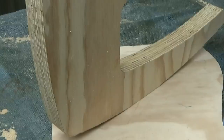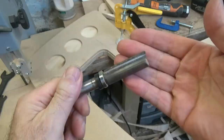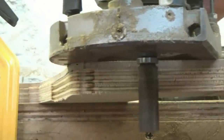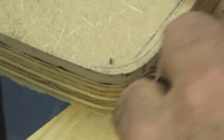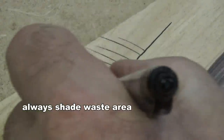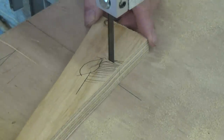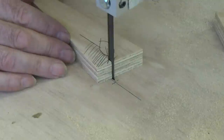So I set up a bigger router and used my top quality router bit — somewhat old looking but perfectly serviceable — and completed trimming that particular part of the edge. To highlight where it was gouged out, I decided to do a little wood surgery. This is what makes wood such a wonderful material. I very carefully traced around the gouged-out section, making sure the implant I was going to use had matching grain, then did a little delicate cutting on the bandsaw, working right up to the line.